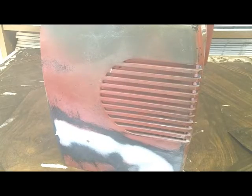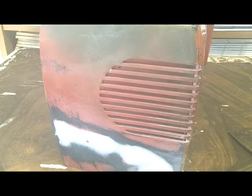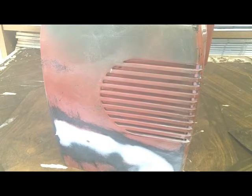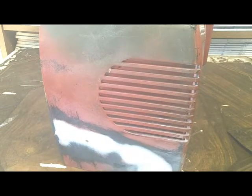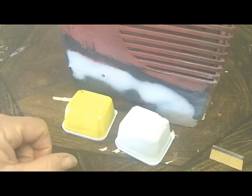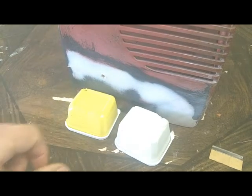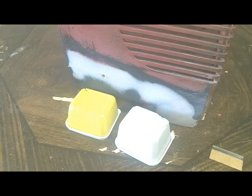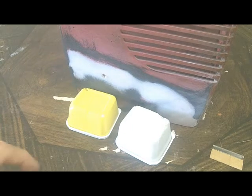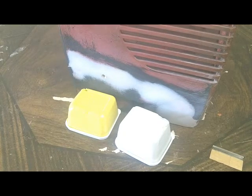You will recall that I need to use this radio to make a mold to repair the speaker grill on the other radio. So I have this two-part item here. It's like clay, or like modeling clay, two different colors, and of course it's an epoxy product, rubber, so that you can knead them together and they will set up into a rubber mold. So I'm going to use about 3/4 of each of these. I hope that'll be enough, because I got another little small thing I've got to mold, and so I'm going to save some of that. So let's get it all kneaded together.